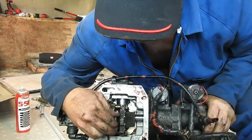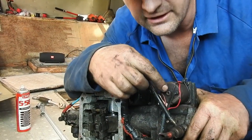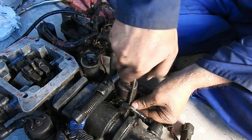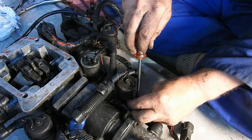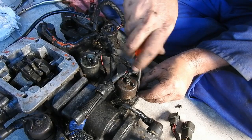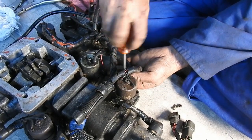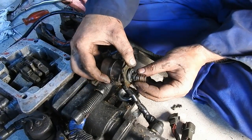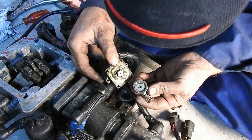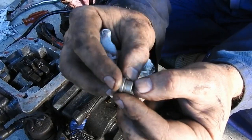It shifts up and down and side to side, just like a regular gearbox. What I'm going to do is pull each of these solenoid valves apart, give them a clean, and put them back together. If you're not familiar with this sort of thing, it's a good idea to video yourself doing it so you know which way to put things back. I've never dealt with one of these gearbox shifters before. Look at all that crap in there. These are the little rubber sealing faces — that one's quite worn but it'll be fine for now.